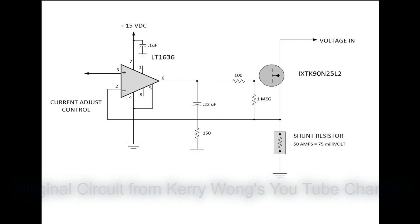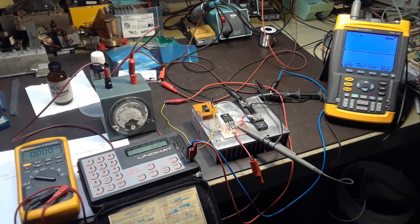The power MOSFET is rated at 250 volts at 90 amps and being designed for linear operation, it was the answer. So I got in some parts and built this little circuit up on an old heat sink I already had. I had the shunt in my parts bin, gave it a whirl, and was very impressed. I was using a little function generator to drive the circuit for control voltage. It only takes millivolts to drive the MOSFET, and I was pulling from zero to 20 amps out of this old power supply very easily, though depending on the voltage applied, things would get warm fairly quick.